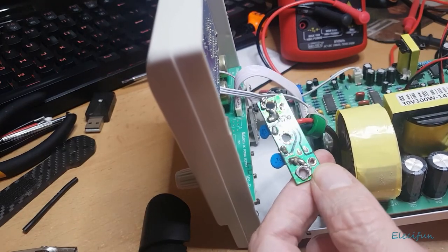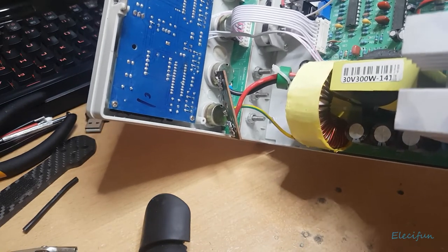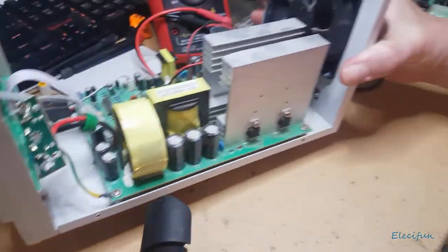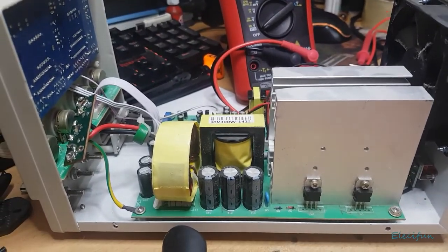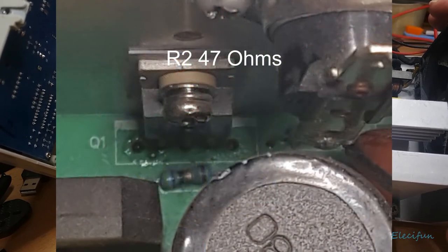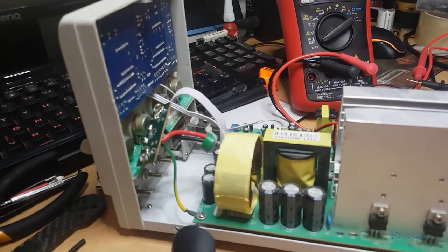The way that terminal connects is absolutely terrible. I'm going to carry on and redo mine again and try to find another nut — there's not a great deal to it. For the money, this thing has been all right. I've had it for years and still use it as my main power supply. I'll give the fan a bit of a clean while I'm at it. I hope that helps somebody. As for those two resistors: one is 47 ohms and the other is between 1.2 and 1.5 megaohms on my meter. See you in the next one!